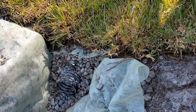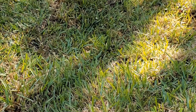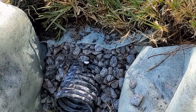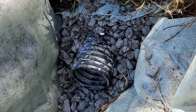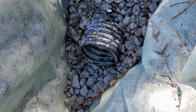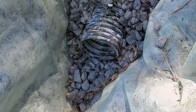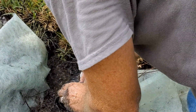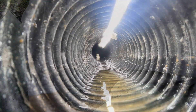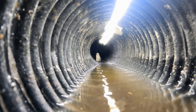We've laid the sod back and I left a piece of it exposed down here so you can see it. I also have a light inside that slotted corrugated pipe — it's perforated with slots all the way around. Let's go ahead and see what happens when we add the rainfall. During a rainfall event, water rises in your trench and comes through at the bottom of the pipe.